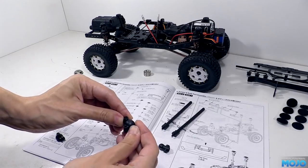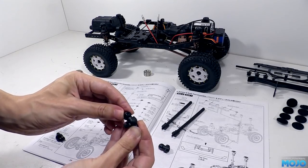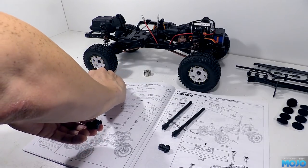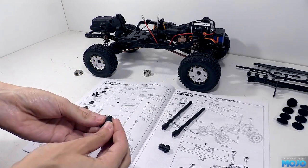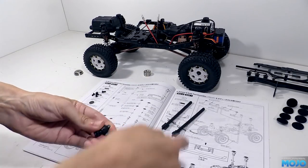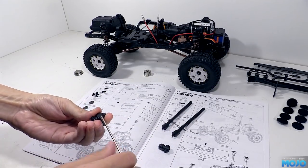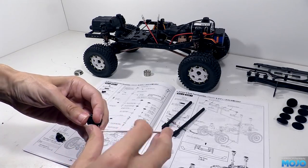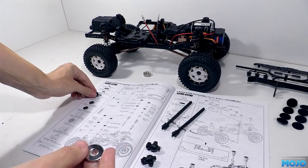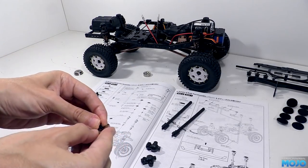The two parts clip together with a little bit of pressure. The ball has flat sides and it lines up in the socket, so you really can't get it the wrong way. The screw goes in through the lug on the socket to clamp the socket to the ball. For now, we'll just tighten it just so it adds a little bit of friction. We'll tighten it a bit more when we're sure it's set to the right angle. On the top of the socket, we'll need to fit two of the magnets using two of the countersunk screws.